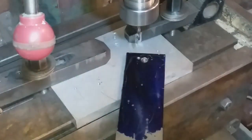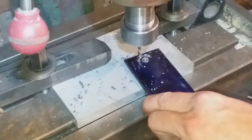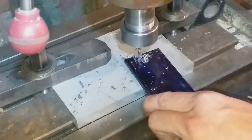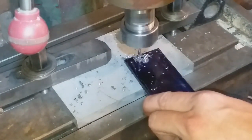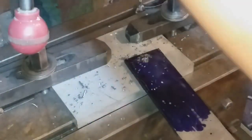Then without the use of a rotary table, I decided it would be a best idea in order to stitch drill a few holes around the main pivot area, which is where the stop pin is going to travel. I then later on went and blended all these holes together to make a nice radius that goes around the outside perimeter of the pivot pin.